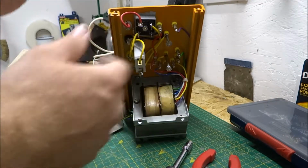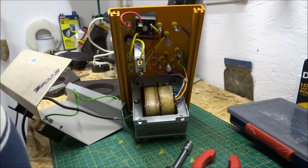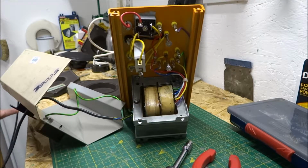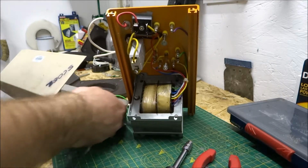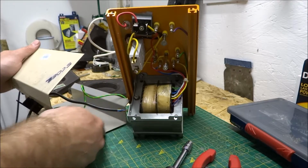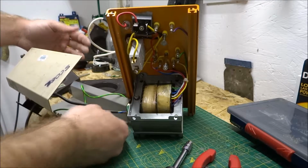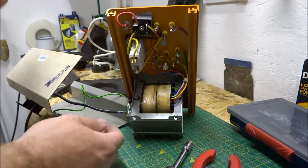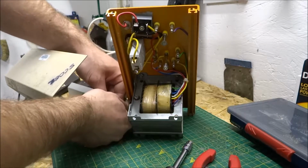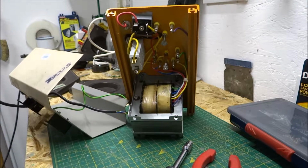Then obviously what we do is we put the piece of equipment back together. I won't show you this because I didn't show you me taking it apart. I have PAT testing here, so what I tend to do is PAT test them because I've taken them apart. Obviously the most important thing is really physically checking you haven't damaged the cable. As you can see here, the supply cable throughout this entire process has been touching the sharp metal edges of this unit, because obviously I've been busy trying to explain it and not concentrate on what I'm doing. So I'm going to make extra sure that those internal cables aren't damaged, and I'm going to check all the cable along the way as well.